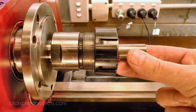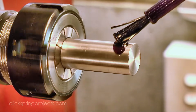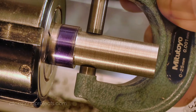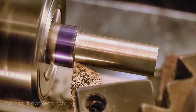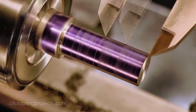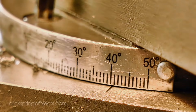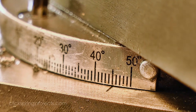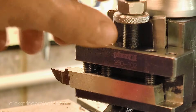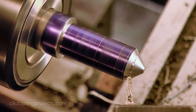The first step was to make that double angled cutter, so I loaded a fresh piece of steel into the lathe and formed the basic profile. The profile features of the cutter are quite small and also very close together, so I'm going to form them using this universal cutter. Providing I don't push it too hard, it'll cut well both left and right handed, letting me make all of the required cuts with the one tool.